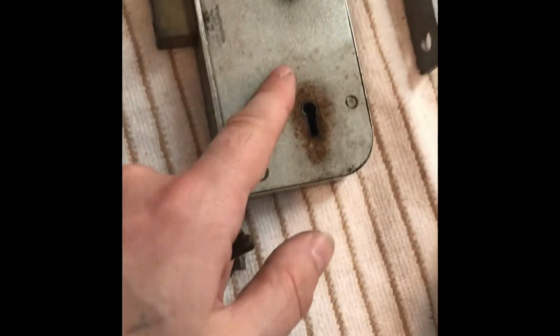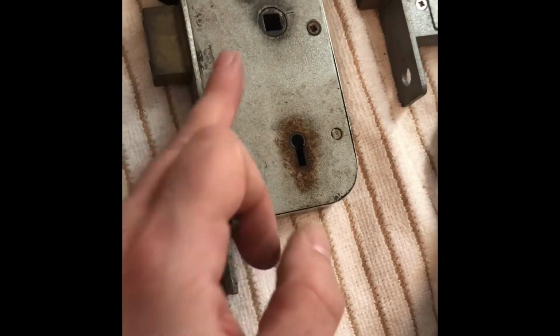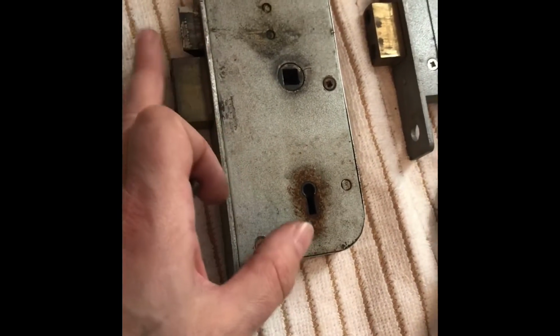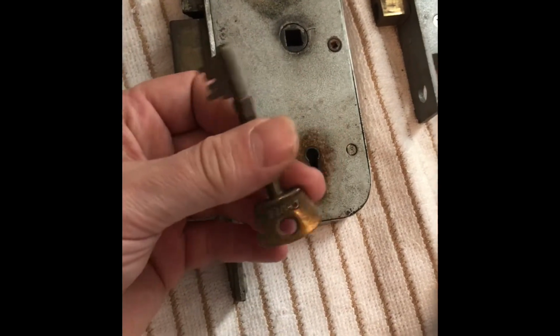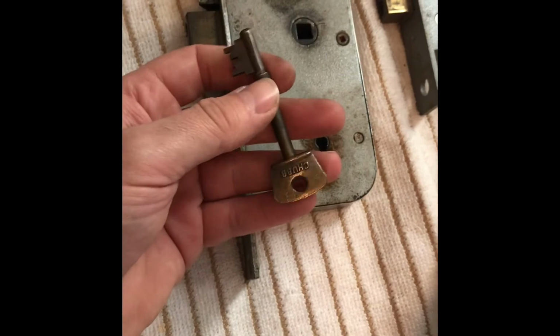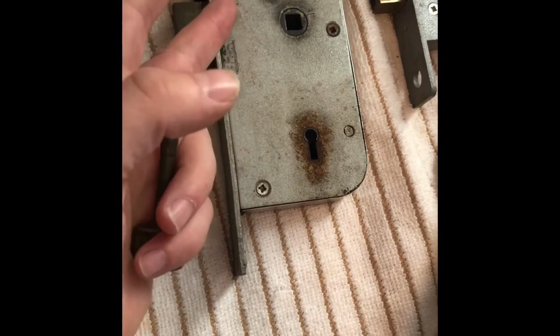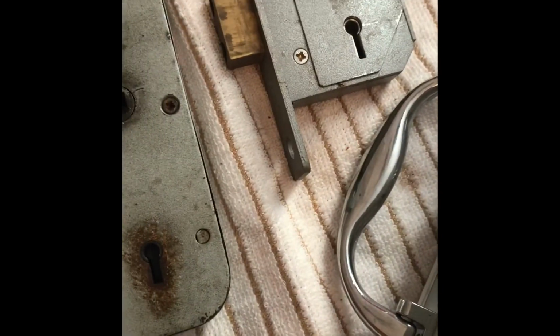So you've got a detainer set in there. Anyone knows how expensive these are to buy. If you came across one of these in a lost key situation, obviously it's really expensive to replace. It's hard work having these in stock in your van, because off the top of my head it's 80-90 quid. But what you can do is have a detainer set with the key, cut 3 new keys if you wanted to, enter the lock non-destructively and replace the detainer set, and jobs are good.